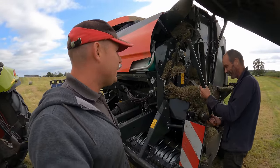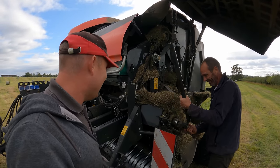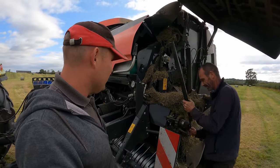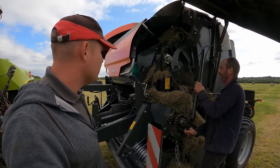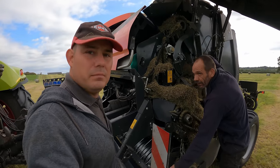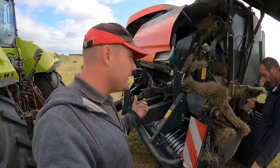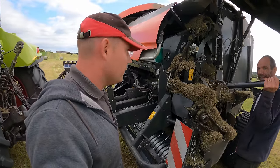If you forgot, you don't make a mess of your panels. I wonder what the spring is for - oh it's a bit of a pain because you can't hold it in until you get a bit of weight on it. Like that - you can turn the little roller like that. But if it's full in the chamber you can't turn the baler, so you just put that clutch out and turn there - you can back-feed everything that's bunged in there, just wind it all out. Because you'll never move the baler with that roller - not with a bale in it.